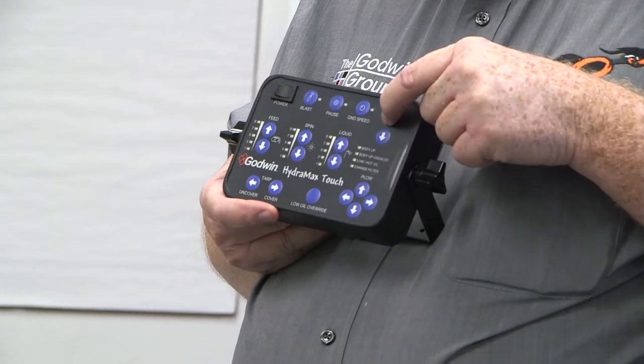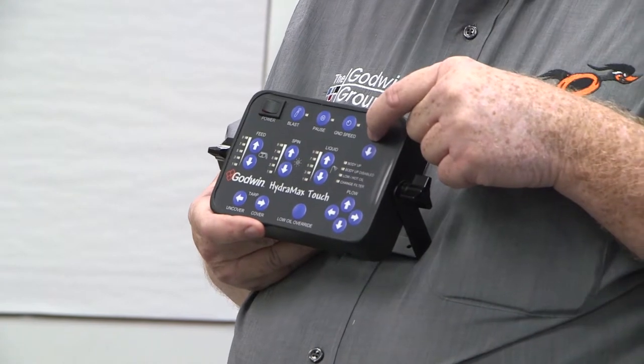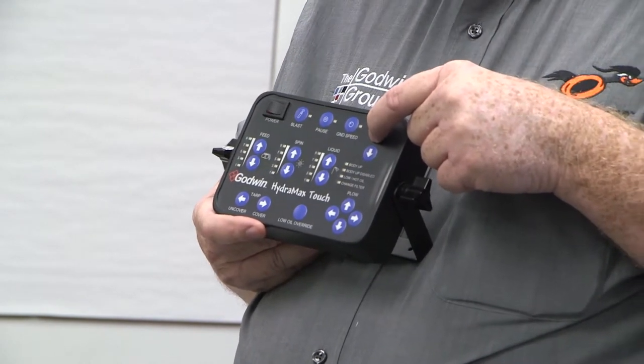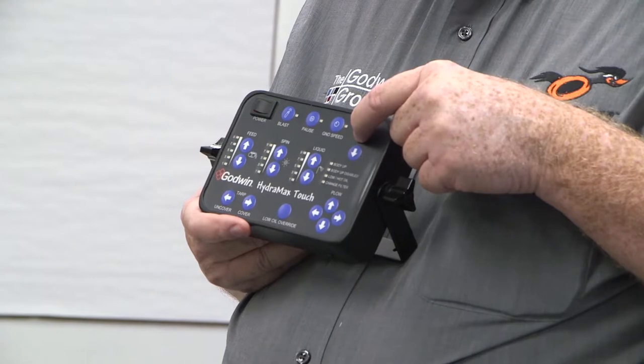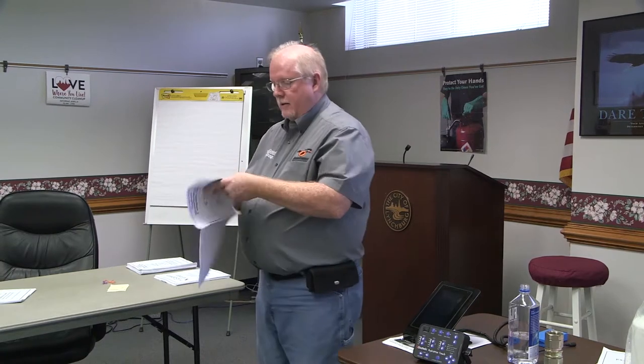So you typically would not turn that on. Here's another thing — step 28, hoist delay. I don't know why they put this in here; I absolutely don't like it. I'm not the engineer that programmed this, although I did have some say, but I didn't object to it. Hoist delay means that the moment that I hit this button, how long is it going to take before the dump actually operates? We can put a delay in it from zero to two or three seconds, so that when we push this button, it would delay that long until it starts to work. I really don't want that. As soon as I hit that button, I want this thing to work — it's just that simple. It's off; it's not set. I would recommend that you don't set that.